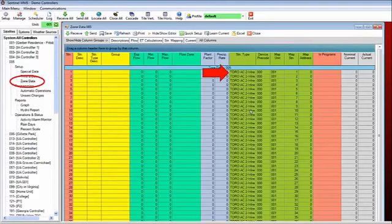Now, when I set this up from the handheld programmer, if I take a decoder, let's say it's a 4-station decoder, and I read it on that handheld programmer, and then I set it to be station 1, it's automatically going to take stations 2, 3, and 4 and program those to be map stations 2, 3, and 4, as you see up here.